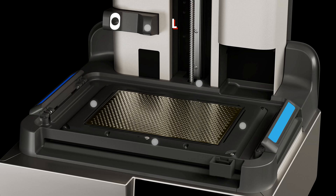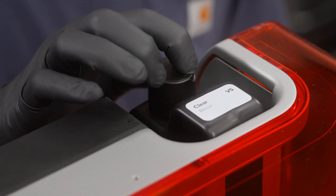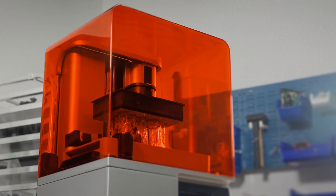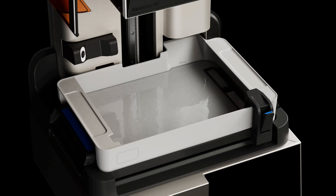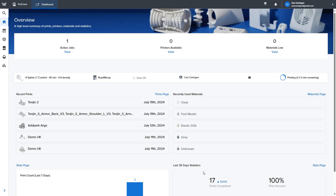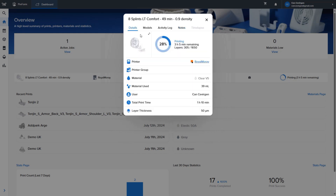The technologies that make a difference are not limited to this. The printer features a level sensor for automatic bed leveling, a force pressure sensor developed to protect the printer in case of potential printing errors, resin heaters on both sides, and a sensor at the front to measure the resin temperature. The device automatically fills the resin — you insert the resin cartridge into place, and the printer automatically detects which resin you have inserted, then transfers the required amount to the tank based on the needs of the printing. While the resin is being heated to ensure ideal fluidity, a resin mixer part ensures the material is evenly distributed across every point of the build platform. As expected, the Form 4 features wireless connectivity, allowing you to send sliced models directly from your computer to the printer, start the printing process, and use the built-in camera to take instant photos or create time-lapse videos.